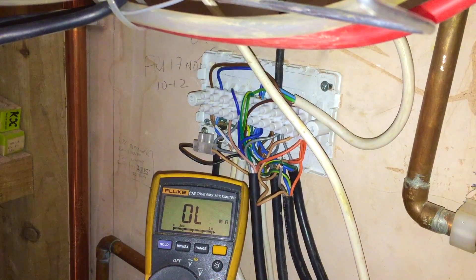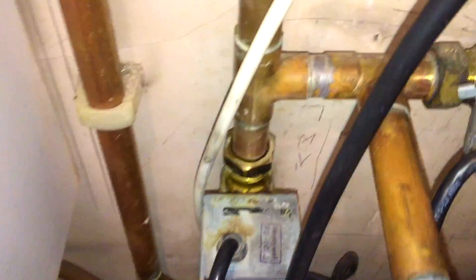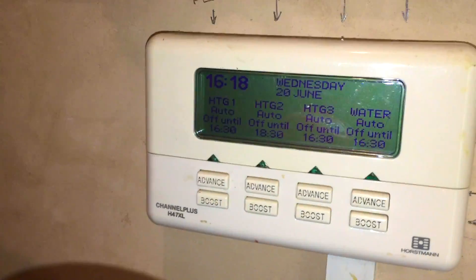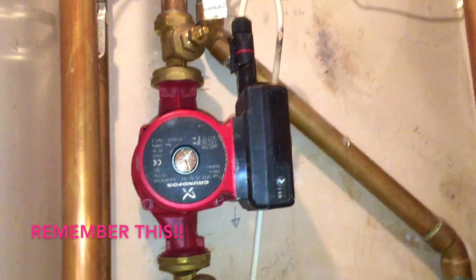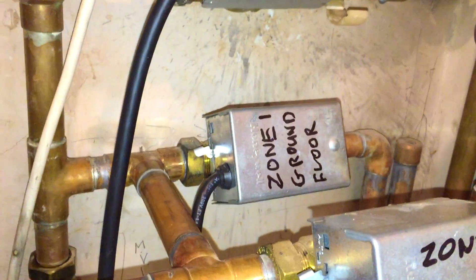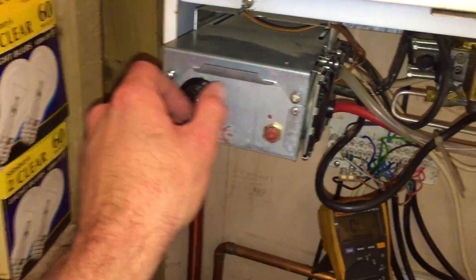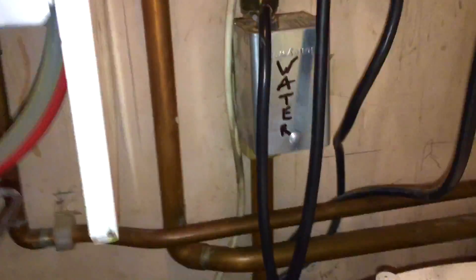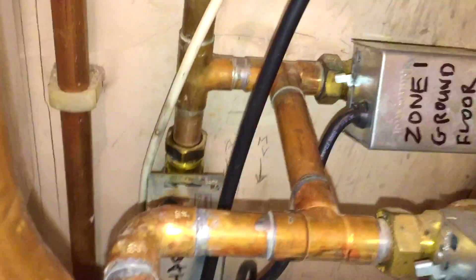So that valve being stuck was causing the boiler to run constantly. I'm going to put that grey back where it belongs, then investigate what's going on with the water valve, because for some reason someone has put that on manual — which is not very good at all on an unvented cylinder. I'll turn the power back on, and the pump is not running. So it was that valve there causing the boiler and the pump to run. The boiler is still switched off on the front, but I can turn that on now and it shouldn't run. So that's what was causing the boiler to run, and now we're going to find out what's going on with the hot water, because the reason it was red hot is because the valve had been wedged on manual.